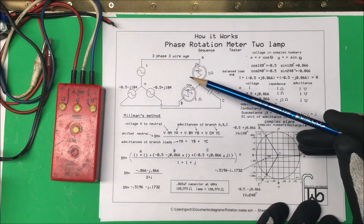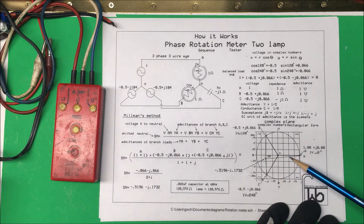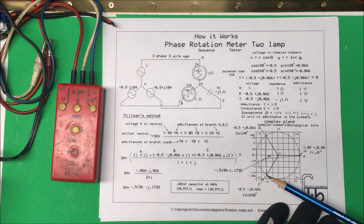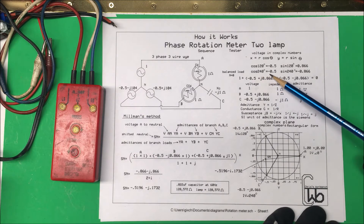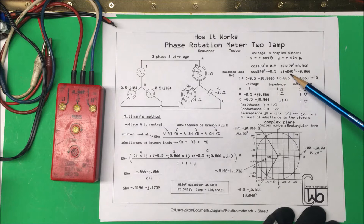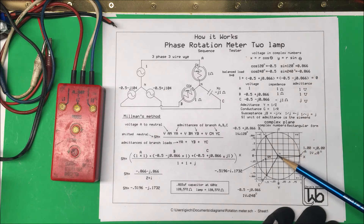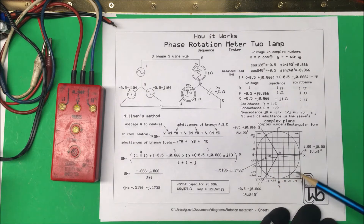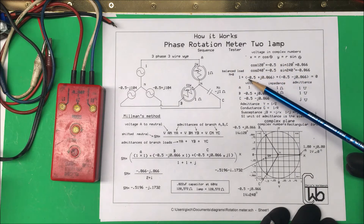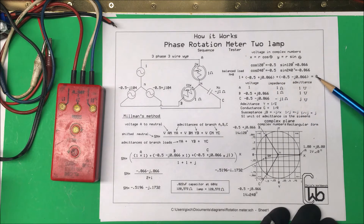Phase C is 240 degrees away from phase A. Taking the cosine of 240 degrees gives minus 0.5, and the sine of 240 degrees gives minus j0.866. So we go minus 0.5 this way and since it's minus 0.866 we come down, and we wind up right there — that's our one volt at 240 degrees. If you add these voltages up — one volt at 0°, 120°, and 240° — they add up to zero, which is our zero point.